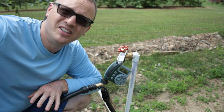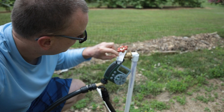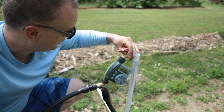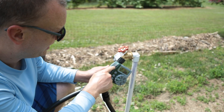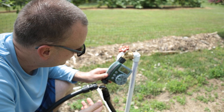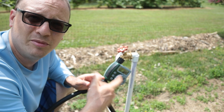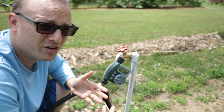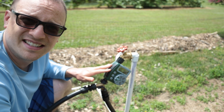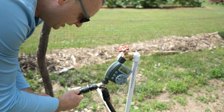All of that PVC runs from the hydrant about 70 feet over here, where I set up a little hydrant. Everything is three-quarter inch PVC, and I have a three-quarter inch brass fitting here for the hose. I got a cheap Orbit timer — I have a feeling I might upgrade it, because the closest interval setting is six hours and I might want to water more frequently than that on 90-plus-degree humid days. For now I can set it manually.